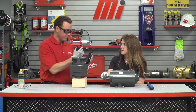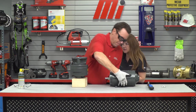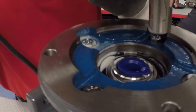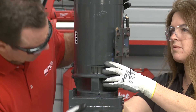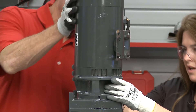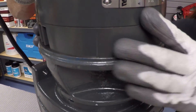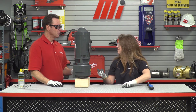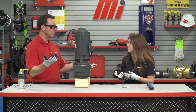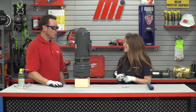If you lift the motor up, we'll align the motor shaft with the key seat and the bushing. That seemed to fit pretty good right there. Then we just want to place our conduit box and line up our bolt holes. The last thing we have to do is put in our bolts and torque them to the appropriate amount, and then we're good to go — we can start our motor and we're ready to go. No alignment or special tools required.